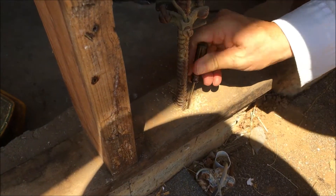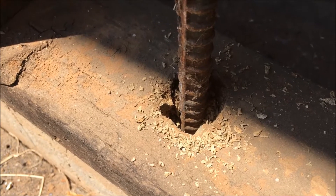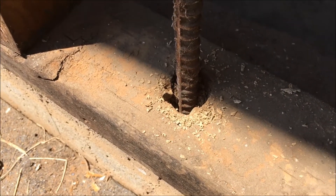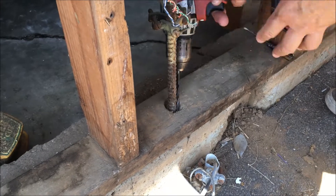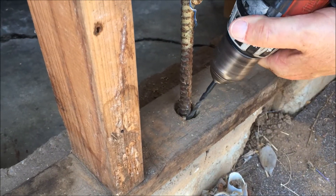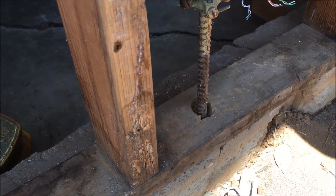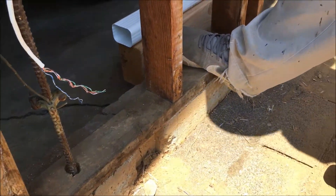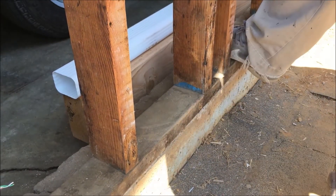Sister's using that screwdriver to feel around, see how much clearance she has, see if she has to drill anything else out. That's how much relief we have for the piece of rebar. We're going to hit that over with a sledgehammer now — the sill plate — see if we can get some movement. She drilled a little more to see if she can get some more movement on that sill plate. It moved a little. There's where I'd like it to move, right there.